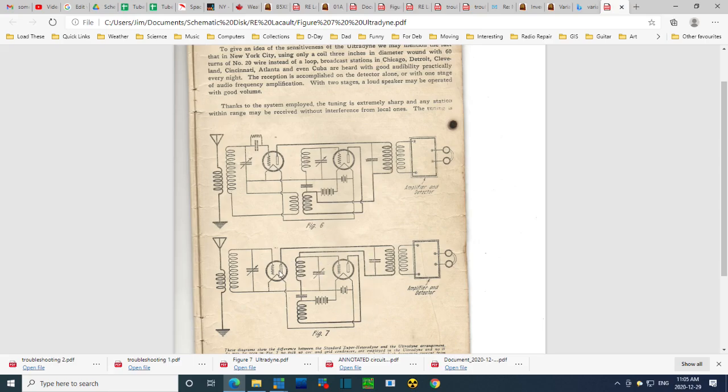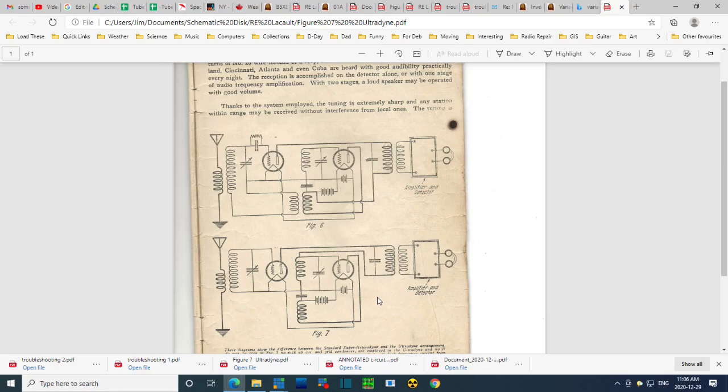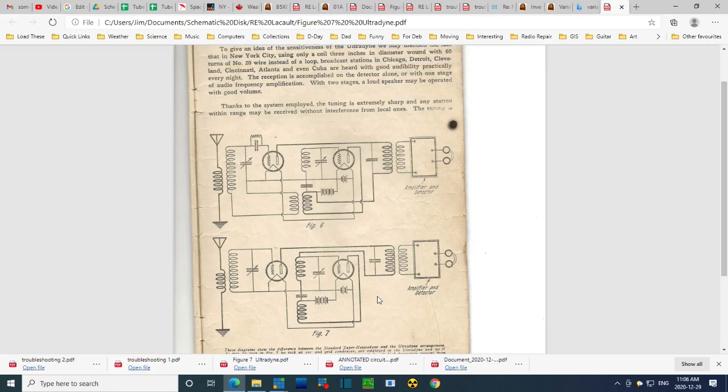So on the plate here is an oscillating voltage of some amount going plus and negative, plus and negative. And that is what is fed through this primary here. This is probably supposed to be the Ultraformer Type A, my guess. There's a capacitor on it in my radio, on the first Ultraformer. Then they didn't bother showing the rest of the radio. They just put a box there with the headphones on the end of it. They just want to concentrate on this part. So where in here is a coil with a rotating piece?